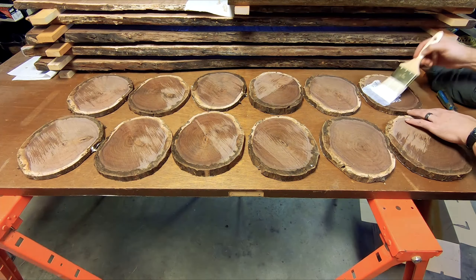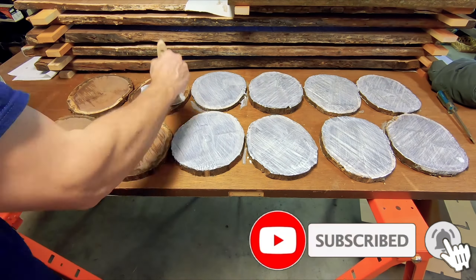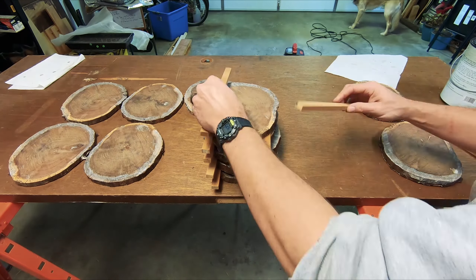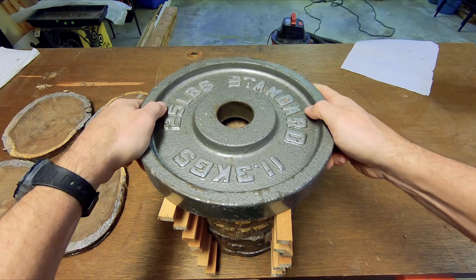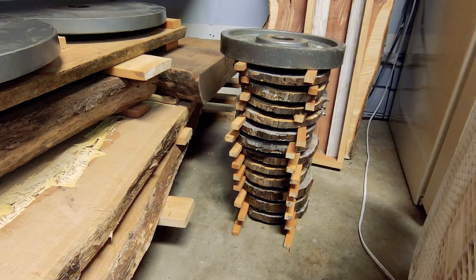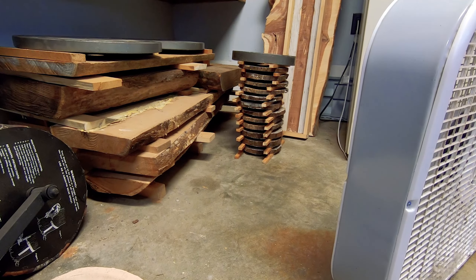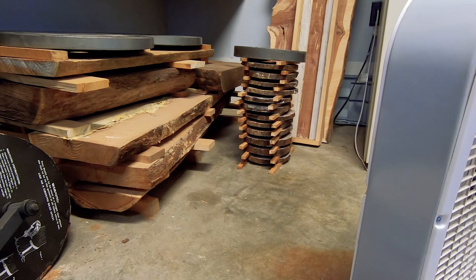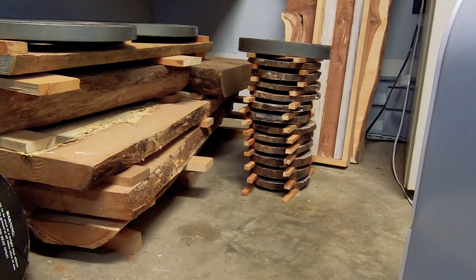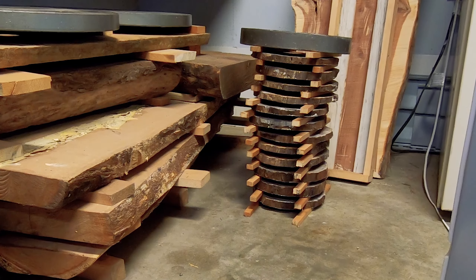The next step is to properly dry or season your wood cookies. I did a video a while ago on the method I use for drying out large slabs of live edge wood, which I'll leave a link to at the end of this video and in the description below, and that method also works great for smaller slabs such as cookies. Wood cookies are notorious for cracking and falling apart in the drying process, so the first thing you'll want to do as soon as possible after cutting them is to coat both sides with a wood grain sealer such as Anchor Seal. You can use plain latex paint for this purpose, but it doesn't work quite as well. Put a good heavy coat or two on one side, let it dry, and then put a coat on the opposite side as well.